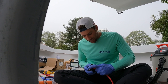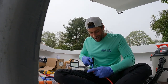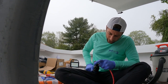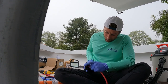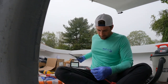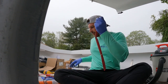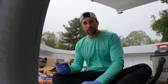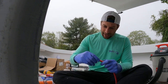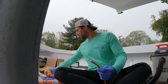There are dies in here that are set for whatever gauge wire you're crimping. One thing that is really important: make sure all your crimps come out really secure. The reason why it's important to use marine heat shrink is that there's an adhesive in here that you'll see come out at the end.